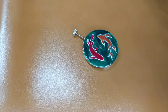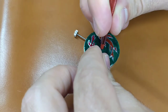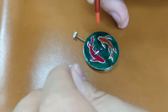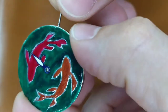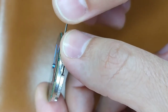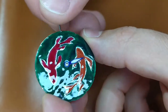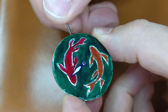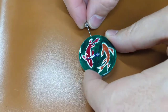In order to put the watch hands, I use Rodico. If you don't use Rodico, you have to use something for dial protection. First, I put the hour hand. It doesn't really matter at which position you put it first, but it must be firmly pressed onto its pinion and should be totally parallel to the watch dial. Always check that everything is working properly and that the hour hand is parallel with the watch dial. In the end, put it at the exact hour marker — this time I have chosen the 12 o'clock marker.